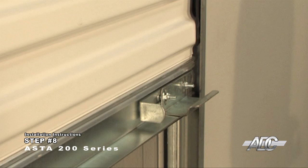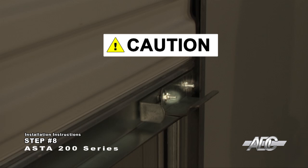When installing slide bolt locks, the threads from the truss head bolts protruding beyond the self-locking nut should be removed to a flush position to prevent the door from hanging up on the head stops. Clamp a pair of vice grips onto the threads and break off the excess if necessary.